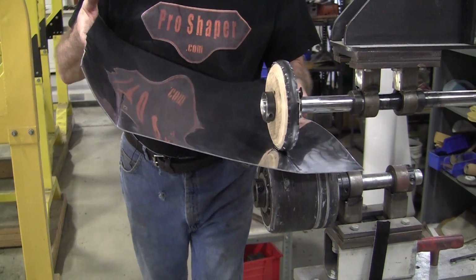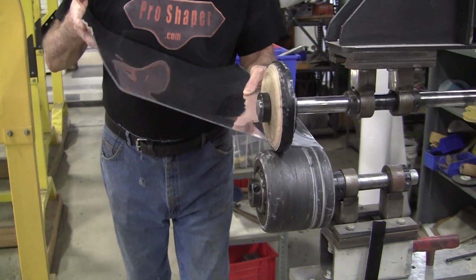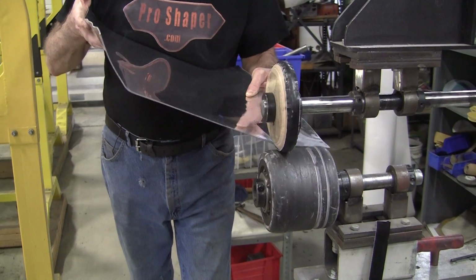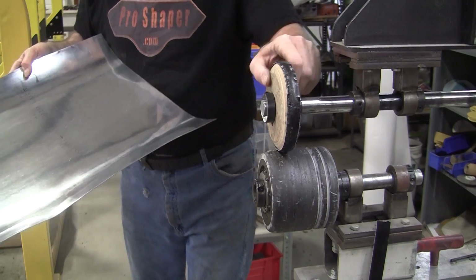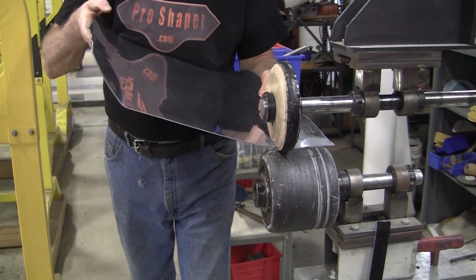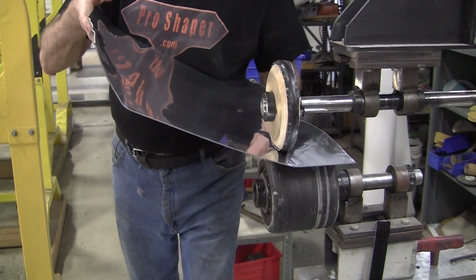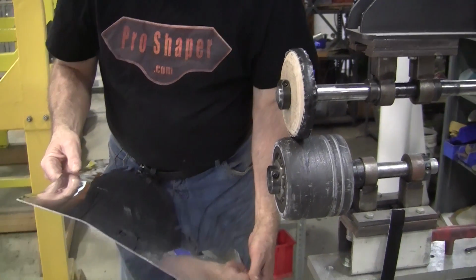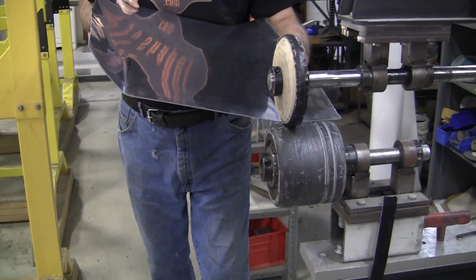I've got one of my old fancy English wheels being used as a frame, but you can make a pretty basic tube frame for this and it would do the job. Very inexpensive to make, and no special wheels. This is a piece of maple turned up on my lathe. I have several lathes, but a lot of people don't have a lathe, but almost everybody has a drill press. A drill press is a pretty inexpensive tool, and with a little creative thinking you can turn a drill press into a lathe to do an operation like making this little wooden wheel.